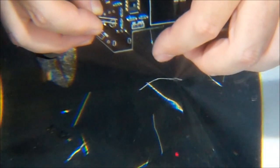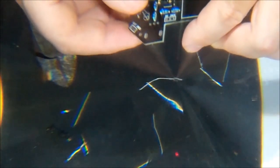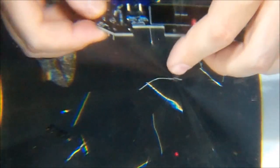But we do have a transistor. This is U4. It needs to go in here. And transistor U4 is supposed to be a 78L05, which appears to be what we have here. Sometimes the writing on these is lousy, so we'll have to bend the one leg back here, get that popped in. There we go. Set that one down there good. That looks good. It's below everything else.